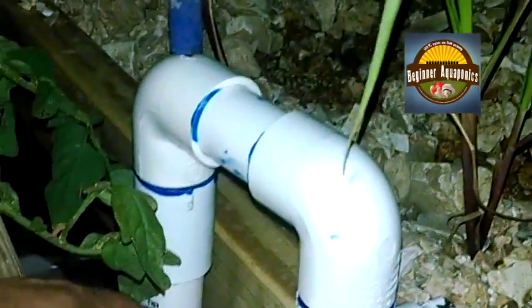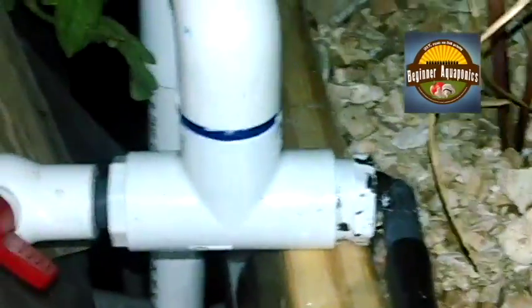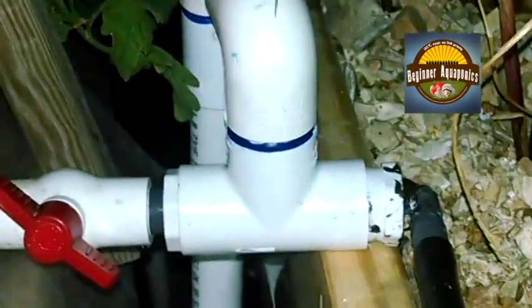I've got a ton of water coming out here. I'll probably change this up a little bit — I'd like a bit more, but if I turn the valve up anymore it puts too much water through my filter and actually fills my sump up and completely drains my reservoir. So I've got a good mixture right now — it's right at the max of what I want for now. I'll probably add another ball valve in that downspout just to slow down some water and push more pressure the other way. This just goes straight down into the filter's one-inch inlet and then out into the sump.